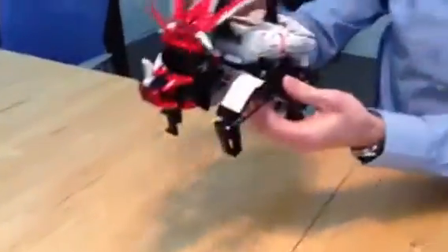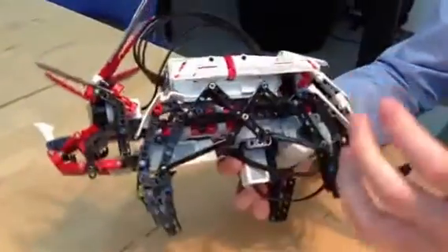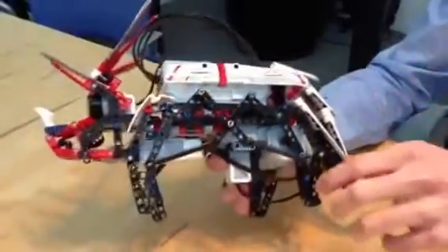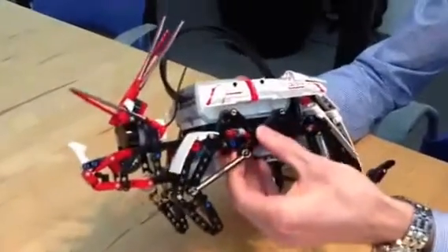The walking mechanism is actually developed by a Dutch mechanical genius called Theo Jansen. It's based on parallelograms, and if you have enough legs and do it in the exact amount that he describes in his formulas, it'll actually be able to walk straight — the whole walking platform will be smooth.